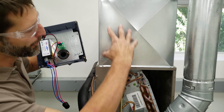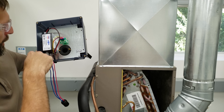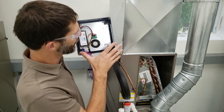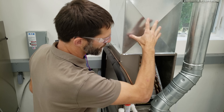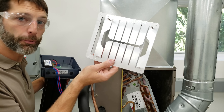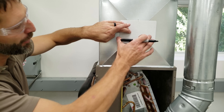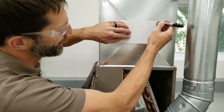The next thing we're going to do is mark our hole, cut it with tin snips, and then screw this in with four self-tapping screws. The bulb is not installed until after the unit is in place. If you're installing this in duct board instead of sheet metal, this unit comes with a mounting plate for duct board, and I'll show you how to use that after mounting this into the sheet metal. I've cut myself a little template for the hole size I need and I'm just going to mark it out.